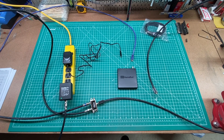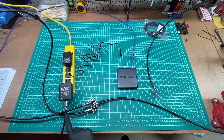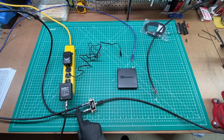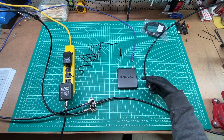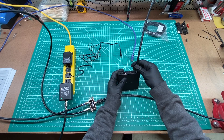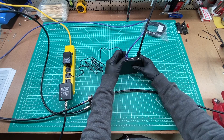Here is my full setup that I will eventually mount onto the wall. We have the preamp power supply here that goes to the right side of this special splitter. The cable on the left side of the splitter is the long cable that goes up to the antenna in the attic, and the top of the splitter is what goes to your TV tuner — in this case I'm connecting that to the input on my HD Home Run. Then you need to plug in ethernet to put the HD Home Run on your local network; note that it doesn't support WiFi.